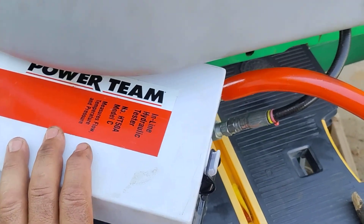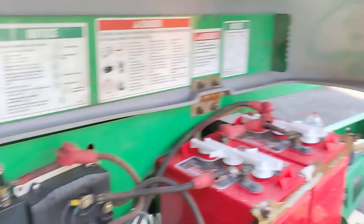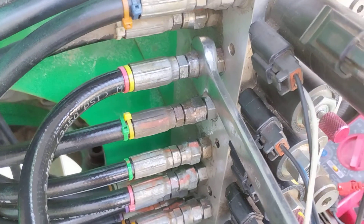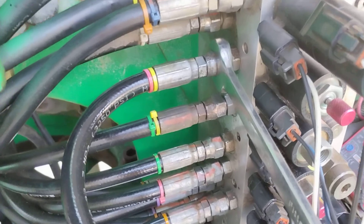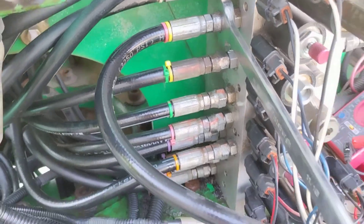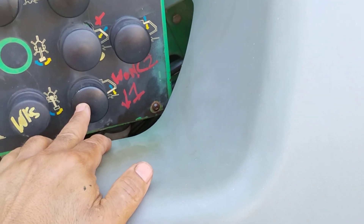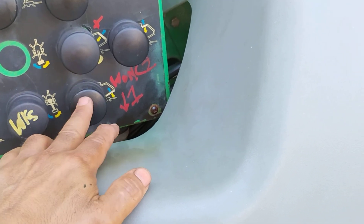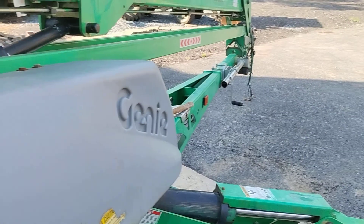Zero pressures — same as yesterday. It's the same gauge inside there. Except now I changed the pistons out there on the primary boom. I changed the hoses out. You see what the wrenches are on, and the one below it — it's the color code you see on the bands. I changed them out so when you press down, you're actually going up, and when you press up, you're actually going down. So now here's my yellow, and this will be up, actually. Watch it move — the boom.